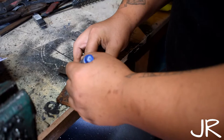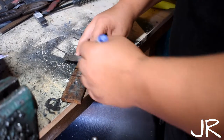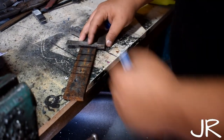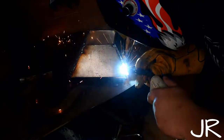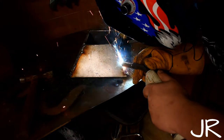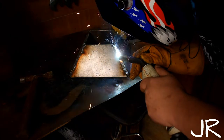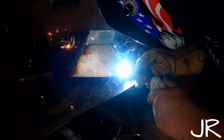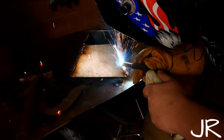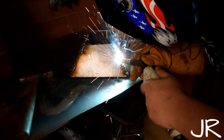Squaring up — a square is at the heart of making almost anything. You can't make a desk wonky; it won't look right or function. At a minimum, squares can help give you the correct angle and a straight reference to score a line with prior to cutting or welding, some even give measurements. You want to make a cut square — set your fences on your saw to your square in both directions, making sure you get that perfect 90. Then when you weld, use a square to make sure everything lines up. Definitely a tool for every workshop.